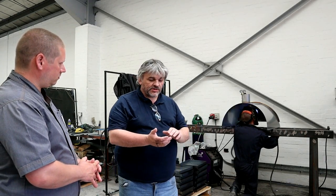Ashley is welding the internal ovens — at the moment it's Vestas. All the internal ovens are the same material — grade 316 stainless steel. We fully weld all the ovens, including the rear and the spigots, and we use MIG and TIG welding in the process. We also weld aluminium, mild steel as well as stainless steel, and there are various different welding procedures on each oven.